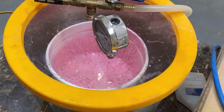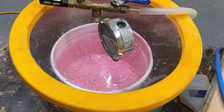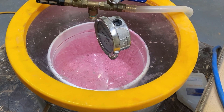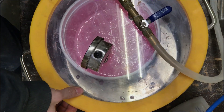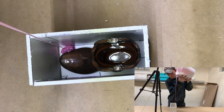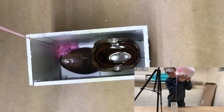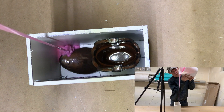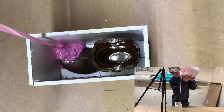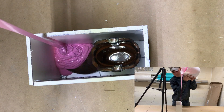We typically vacuum it three times — we like to get it to boil and collapse three times. It rarely fully boils and vacuums completely three times; it just depends on how much air is in there. After the second time here most of the air was gone. Now he's moving over to pour it. To help get the remaining air out, hold the bucket up high and pour it in a narrow thread or ribbon — that tends to pop a lot of that remaining air out as it goes down.